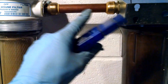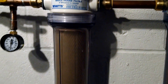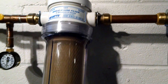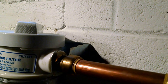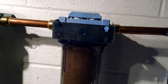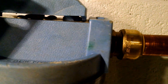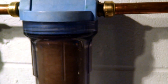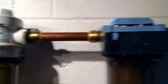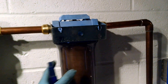Once you turn it to bypass you can unscrew this and it's not connected. If you have it set to off, I still get pressure coming in backwards for some reason — I think it only blocks from one direction when set to off. I like this housing; I like the clear container and the bypass feature. It was about $40 on Amazon and I used shark bite fittings so I have the ability to move it around. It's attached to the wall with anchors and a steel bracket. This other one I got for free from a Craigslist deal — it has a button to relieve pressure before you remove it. I haven't mounted the bracket yet, but it's nice to have because when changing the filter you need to yank on it with a filter wrench and the bracket holds it tight.